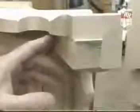With all my pieces nicely sanded, we've taken the base of the prototype and flipped it up on some sawhorses so I can show you what's going on underneath here. There's a lot happening. There are some plywood fillers to bring it even with the face frame. There are these poplar blocks which attach the foot assembly to the carcass. And in the corner, there's this post, which is sort of like a glue block, but it's longer than the foot assembly. That way, when you slide the piece around or when it's resting in place, the pressure is on the post rather than the decorative element.